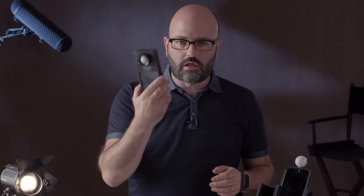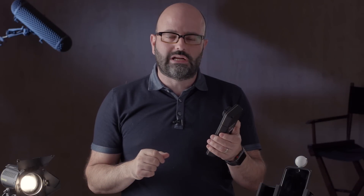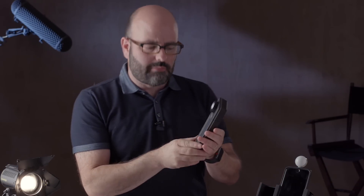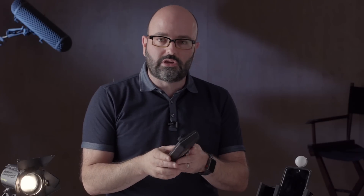What this means is that when we're using color meters — this is the C700 from Sekonic, their SpectroMaster meter — we want to get an accurate reading of all the information coming from those fixtures. Those modern LED fixtures don't have the same color spectrum as a quartz halogen hot light, which gives you a full color spectrum at a rock-solid 3200 Kelvin. An older color meter with just red, green, and blue receptors wouldn't give accurate readings, which is why things like the C700 exist. They also provide color rendering index and TLCI so we really know the color spectrum, where there might be gaps, and where there might be problems.